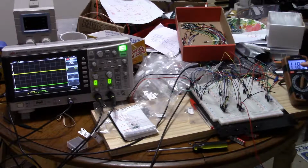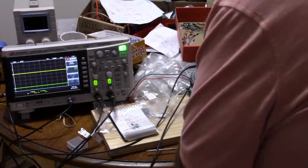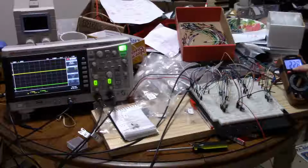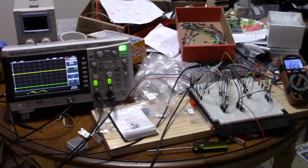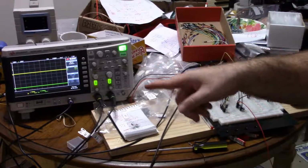So this one is reading about 1185 ohms. So just like 1.2k ohms, 1200 ohms. The other one, because they won't be exactly the same, is reading 2.28k ohms, because these are 50k, so there's only so much precision I'm going to get with a screwdriver. So somewhere 1k, 2k-ish is the sweet spot for that system.